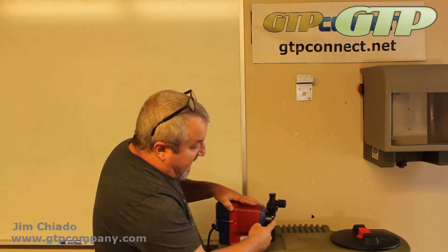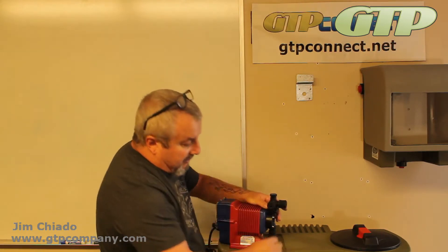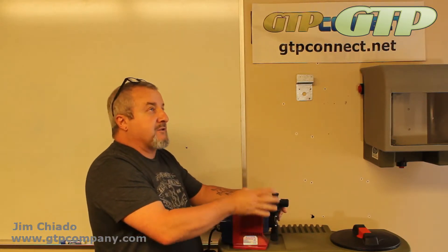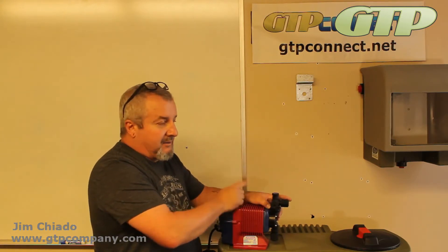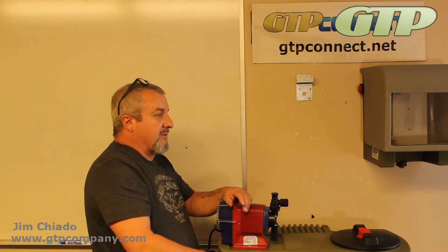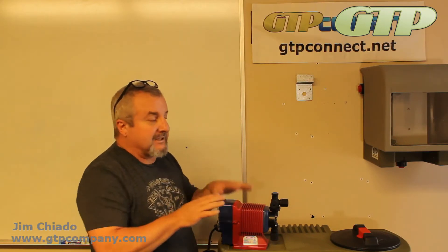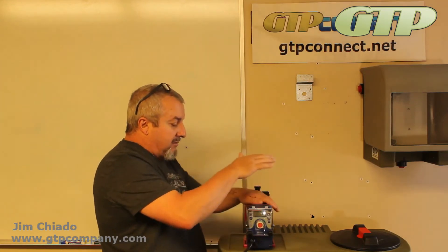On the back side you'll see the pump head. The diaphragm is here, and this is the manual priming valve that comes with all of them on the suction side. One important thing to remember: if you ever take it apart, make sure you put your check valves in properly. There is an upside-down and an upside-right orientation for those check valves. A lot of people take it apart just to see what's going on or for priming, and if you put them back in upside down, it's not going to work.